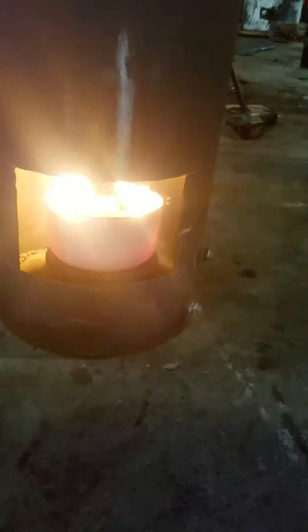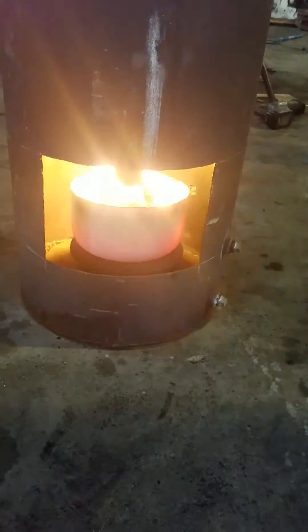You can see the paint is burning off the burn bowl, which is now turning molten red. I've decreased the oil — maybe a little too much — so I'm going to open it up just a hair. Once you get this kind of adjusted, you can pretty much walk away from it. Oh, I've got a hole leak over here. Something's wrong. I'm afraid I'm burning a hole in it. Okay, keep an eye on that — that might be just a residual drip. But that's why I do these tests.